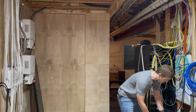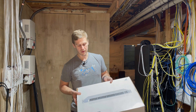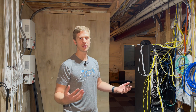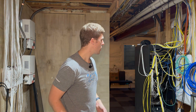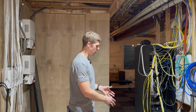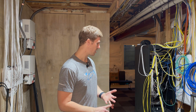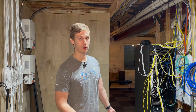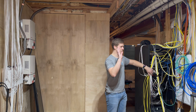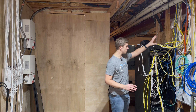I actually have my old switch from my old house — the standard 48-port, 500W. This is going to become the IoT switch: not high-data, not the high-importance stuff, but things like Sonos, receivers, stuff that wants to talk to the internet but doesn't need tons of bandwidth. They're streaming music, maybe video at most — or they talk to the internet just for updates or so Home Assistant can talk to them to change channels. So that's going to go on the old switch because it's standard PoE, standard gigabit per port. No IoT device needs more than 10 meg, let alone a gigabit. So some of these audio cables that run to speakers and control panels will stay down here, and then some will split off.